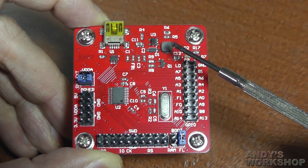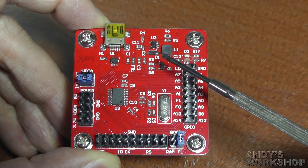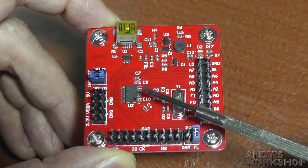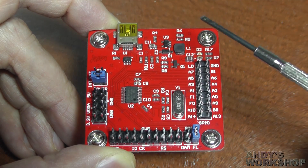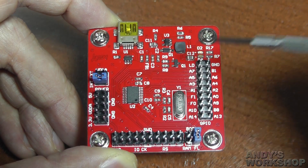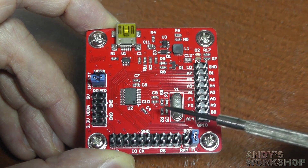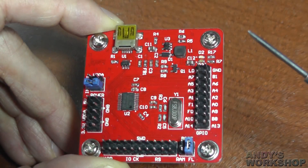I did it that way because I didn't include the smaller parts in that stage — they have a habit of blowing away when you're not using solder paste to hold them down. They blow off the little tinned pads in the reflow oven, so I just did the ICs in that stage. Afterwards I used my hot air gun, my 852A, to place the 0603s around the board. It's really easy — you point the gun, place the components, and with flux pre-applied to the tinned pads you just reflow them. The final stage was the through-hole components: the pin headers and the crystal, which went down with a normal iron.